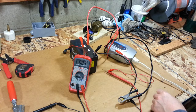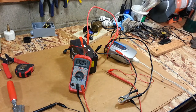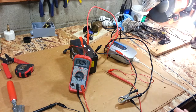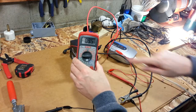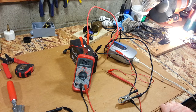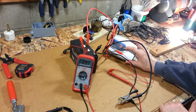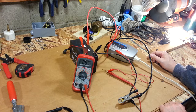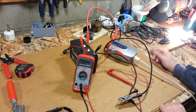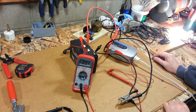I have a 100 watt light bulb plugged into the inverter. Turn it on. So minus 9.5 amps — I'm drawing 9.5 amps out of this battery right now. The inverter says it's 90 watts at 12 volts. Let's say that's pretty close.